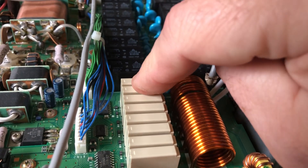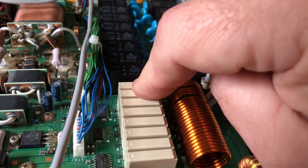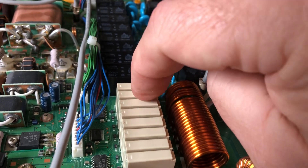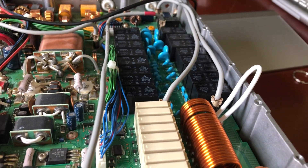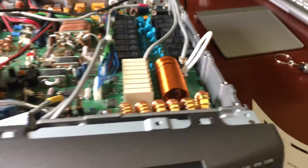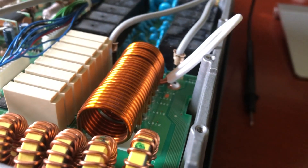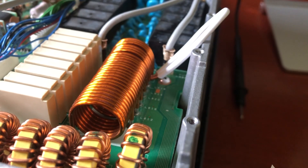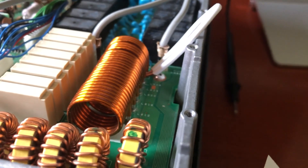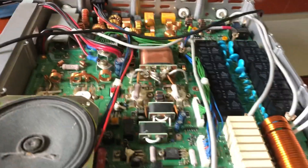This radio is one of the 30 million serial numbers — it was made in 2001, so it's getting old enough that I should replace both of these relays to eliminate that problem completely. That's our problem: one of the relays isn't kicking in. If you were in a pinch, you could solder a little jumper between the two, but you need that coil in every tuning situation. These parts go bad, and the radio works beautifully other than the antenna not tuning.